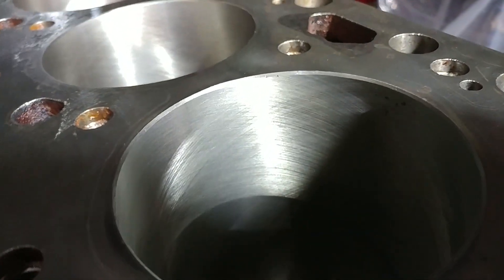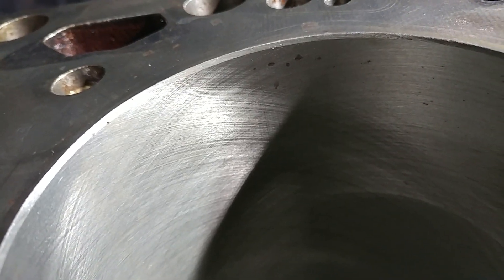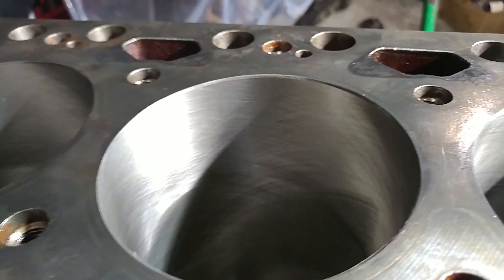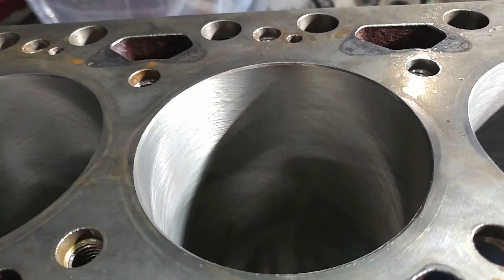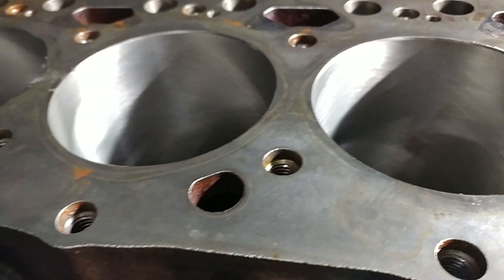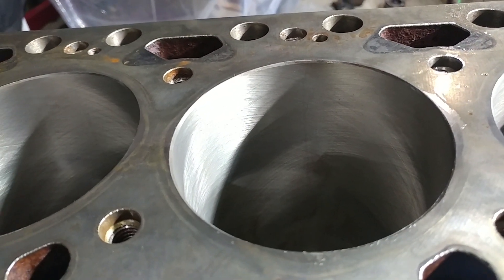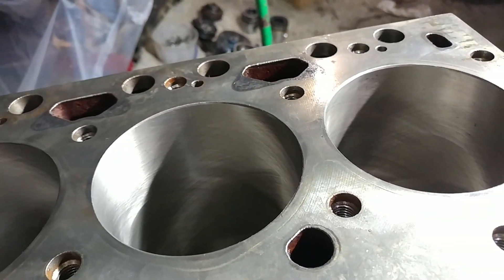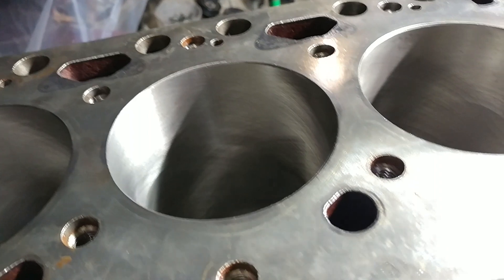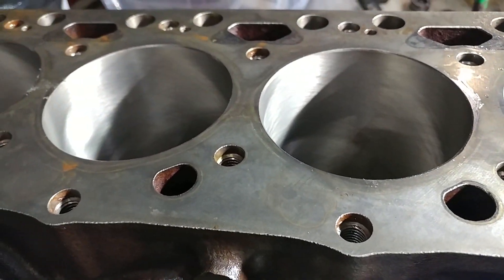Here's one of the next videos that we wanted to do. If I can get out of my own light, you can see some of the surface rust there. We'll have to get a little scotch-brite action after that — a very, very fine one. It's what we generally have used, and our machinist has said to polish up any light surface rust that comes on there. And before we put this together, you can see the oil that we've thrown on it to try to keep the rust off down here in the south.